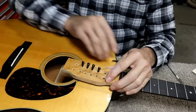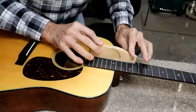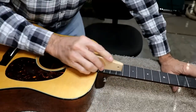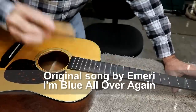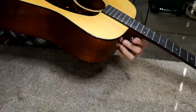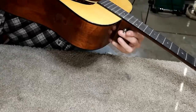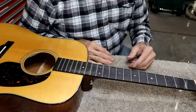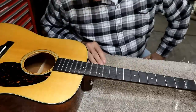I can hear a very minimal buzzing in this area, so I'm going to set this fret in here — there's a little bit of a rock going on, not very bad. That's kind of typical; you have to expect that because your fretboard bends back down, but you can file through that and get rid of it. Looking down the frets, it's pretty level — if anything, it's probably got just a minor, minor amount of overbow, which should come out when we string it up. So I think it's just about perfect: flat to just a hair of overbow, which I think is just about right.